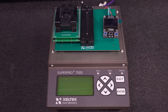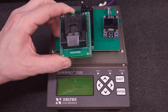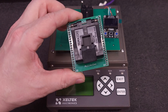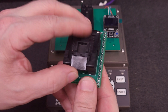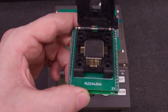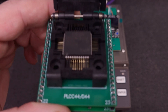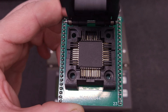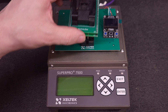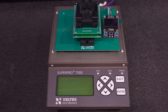We're going to demo the magic chip for the 7500. I have it already installed onto a GX001, in this low-cost seven to ten dollar adapter, which is a PLCC44 to DIP dual inline package. I have pre-installed an NXP-P87C51MC2. We're going to demonstrate this magic chip because I failed to do so on the last video. This will be a quick video showing you that it won't read with the incorrect adapter ID set, but it will read with the correct adapter ID set.